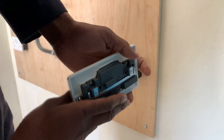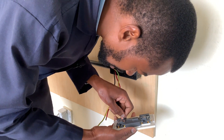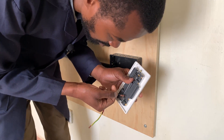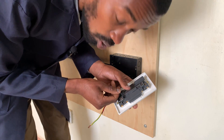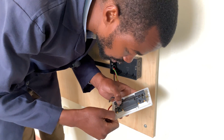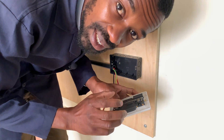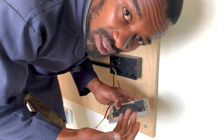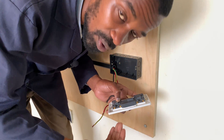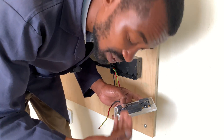This is a very powerful and strong socket. I will simply connect there. It is important to note that your wires must go all the way in, and ensure that when connecting, the screw will not bite the insulation but will screw the copper wire, so that whatever appliance is connected will not strain to get its current supply or to complete the circuit. A strain in the circuit brings problems such as under-voltage, which may cause damage to the appliance connected.